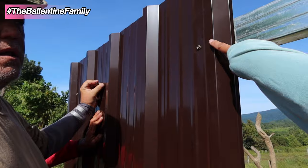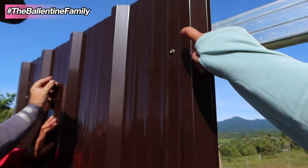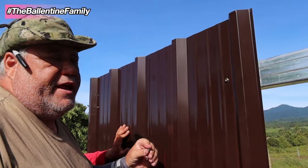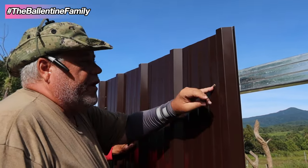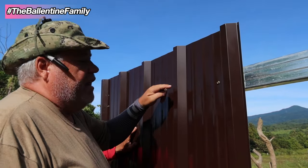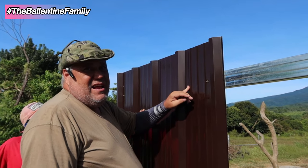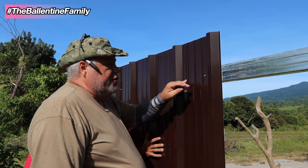In Filipino practice they put the screw in the ridge, so it crushes the ridge. But the purpose is manufacturer specification — if you go on the internet and look, when you use the right rubber washer and you don't squeeze it too tight, this will never leak. If you put it in the ridge it bows it down and leaves a spot for water to sit in, and then it rusts through. So manufacturer specifications say, if you go online and look for high ridge metal roofing, they will tell you to put the screws down in the valley, not the ridge.